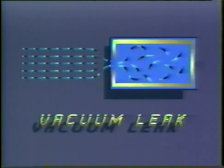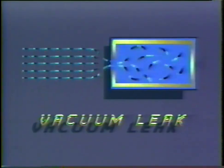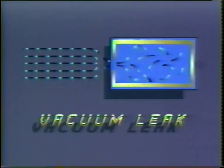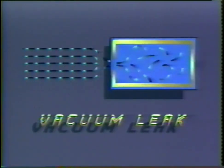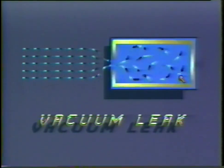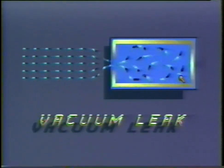The same is true for vacuum leaks. The only difference between the two is that a vacuum leak will usually generate less ultrasonic amplitude than a pressure leak of the same flow rate. The reason for this is that the turbulence produced by a vacuum leak is occurring within the vacuum chamber, while the turbulence of a pressure leak is generated in the atmosphere.